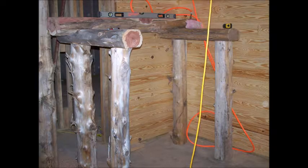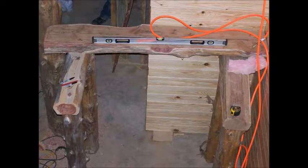The platform was moved from the outside to start the assembling in the inside of the stair hole. It was set on 4 58-inch long legs. Each rail was leveled in. We drilled holes, countersunk them, and lagged these rails down to the post permanently. And then we'll start on the first log for the platform.